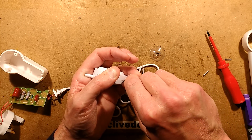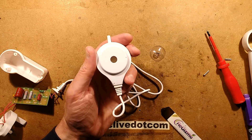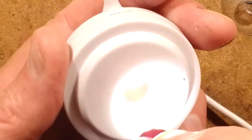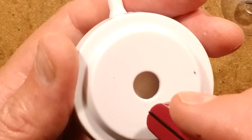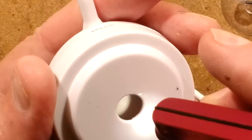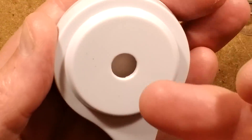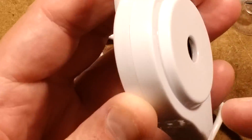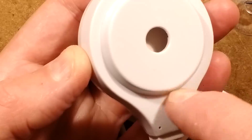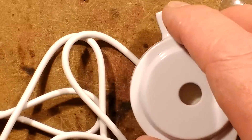Yeah, that feels too tight — I think it is welded shut. What I can see inside though, if we zoom up and I shine a little extra light, I can see the metallisation of the piezoelectric disc. I can see the metallisation of the disc in there, suggesting that is the active side of the disc — the layer of the piezoelectric crystal — and then the brass disc itself. This will just be a piezoelectric transducer, and that's fundamentally it.